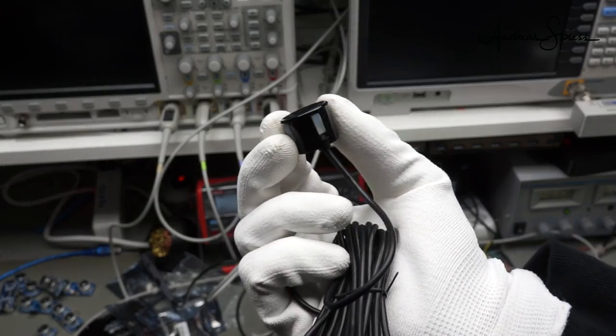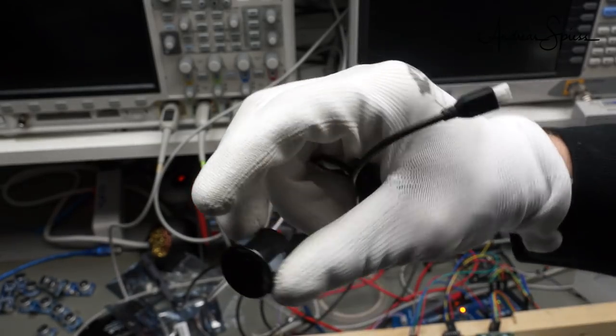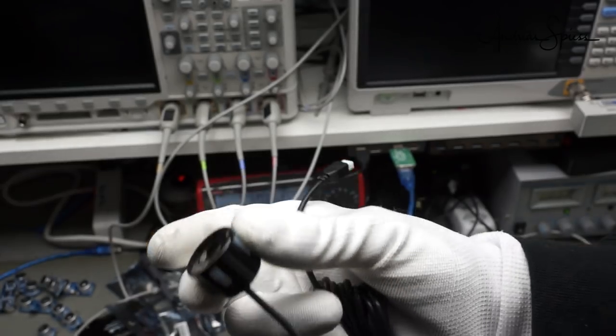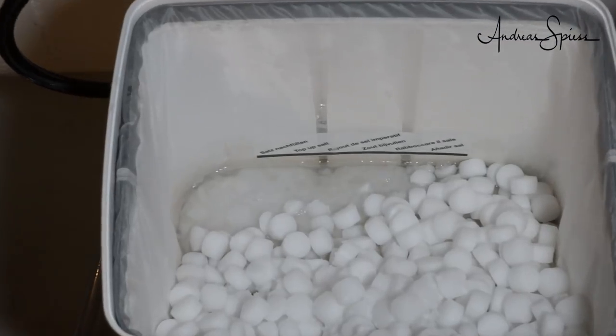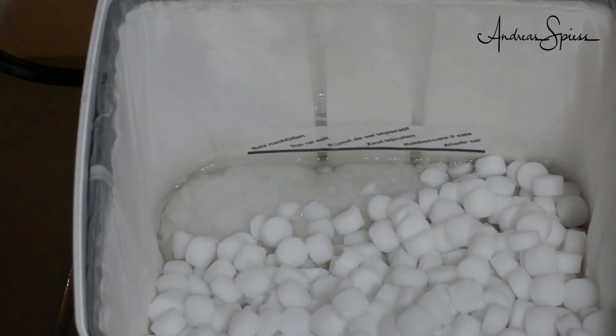What could be the usage of such a water-resistant ultrasonic sensor if you already own a car with parking sensors? One of my viewers had a good idea: to not forget to fill salt into a water softener. I want to mount such a sensor on the top and measure the distance to the salt level. An ESP32 could do this once a week and run on battery for quite a while, so I would not forget to fill it up anymore. Maybe a project for a future video?